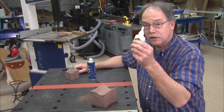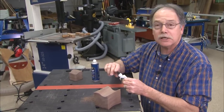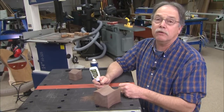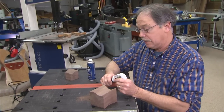Final tip, thick viscosity glue: squeeze the air out of the bottle, put the cap back on, and the glue doesn't get hard on the tip, so you never have to replace tips. Then store it upside down. That makes sure that you have that nice and airtight. I can keep super glue for 2-3 years that way.